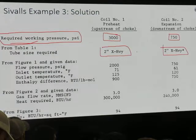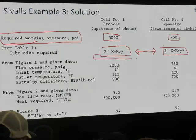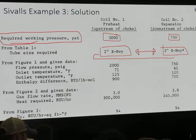All right. So if we don't think that there's going to be shut-in or anything, we may go with something else. When it shuts in, we don't shut in on the choke itself. Yeah. We didn't close the choke. If we close the choke, it's fine. But if there's a problem downstream, so the gas pipeline decides, oh, we somehow have water in it and it closed. They will try to tell us, but sometimes if there's an emergency shutdown of the pipeline, they close it over there, the pressure will start to build up. So maybe, yes, it's a good idea to have both pipes withstand the shut-in pressure.